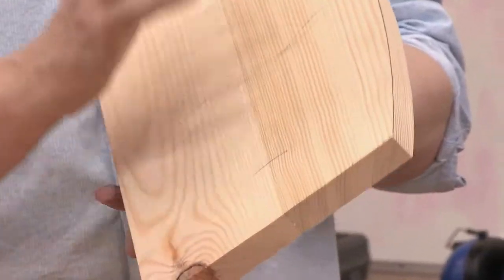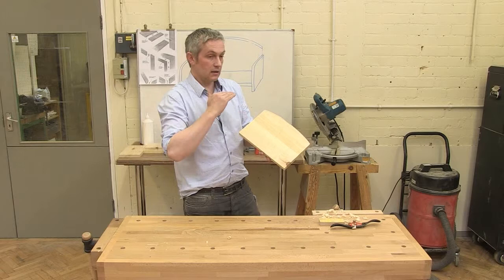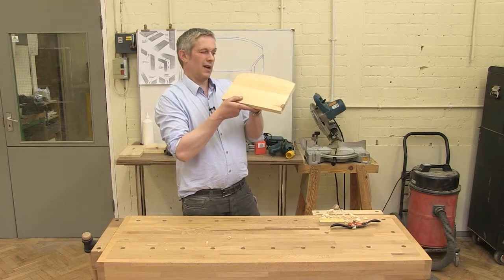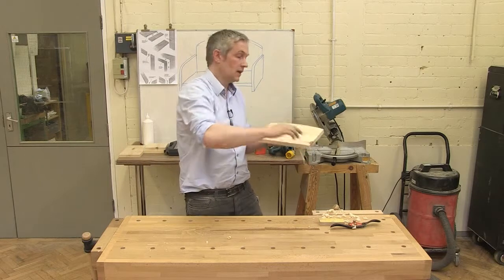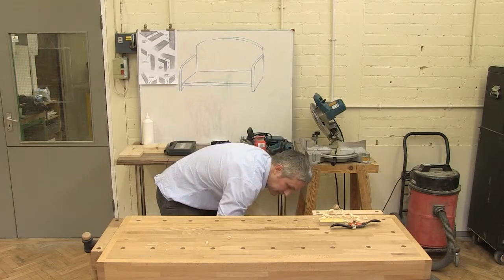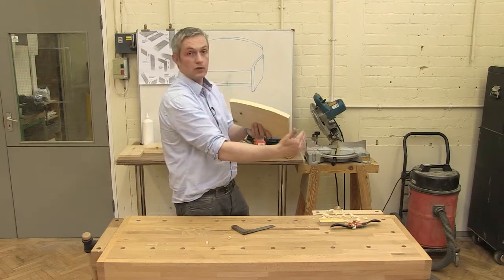To do the other side I turn around and work that way. I'm nearly down to my pencil line now. Just before that final shaving, I want to make sure it's a nice sweet curve with no humps or hollows — a sign of good quality curved work. I shut one eye and look down that curve, almost ignoring my pencil line because the spokeshave, if sharp with that rolling motion, will produce a nicer sweet curve than the pencil line alone. No humps, no hollows. I'll get my square, check it's square all the way along, take a really fine cut down to the pencil line on this front edge, then turn around and do the other side — and that should be really nice.